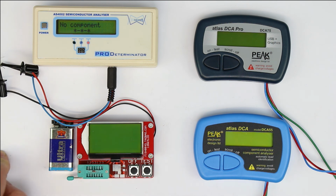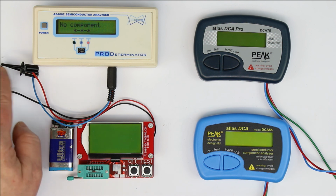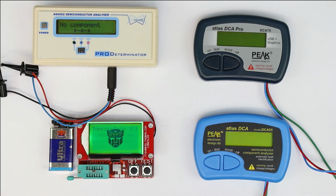It should be able to detect that if it connects the plus side on the anode, it's a normal diode, and if it connects the plus test voltage on the cathode, then it should measure 2.7 volts. So it could deduce from the measurement result that it must be a Zener diode, but it doesn't, even though the voltage is low enough concerning the Zener diode that it should be able to detect. Let's see what our fish does after waiting some seconds.